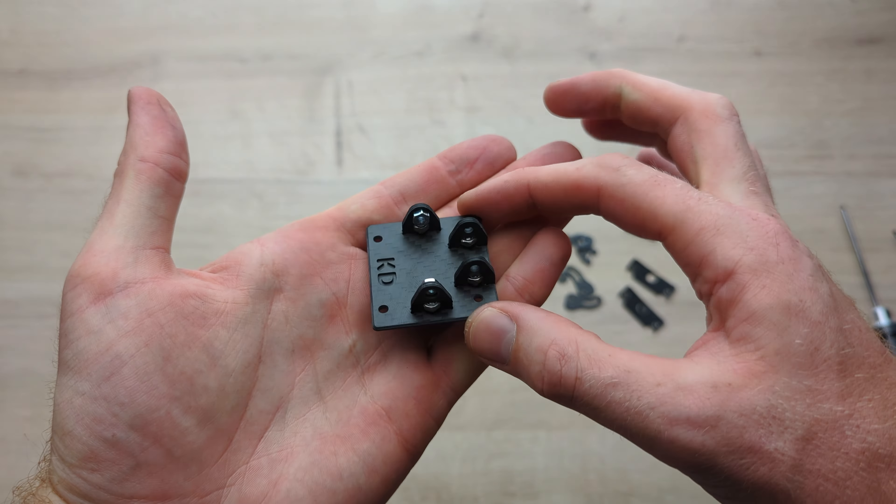The next thing we need to do is get these tiny little spacers. Those are going to go in between these holders and the arms. So we're going to get another one of these M3 by 10 cap head screws with a washer, and get one of these spacers and put that through there so it just fills that gap. Get the 2.5mm driver and screw that in through there into the press nut — that's going to line it up nicely. Do the same thing on the other side, and that is the mount fully assembled. You can see the opening and closing — you can loosen up everything to make it easy to adjust and then tighten it all up.